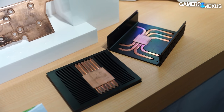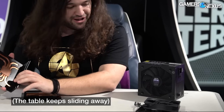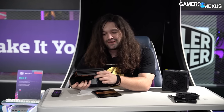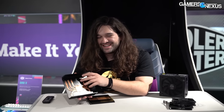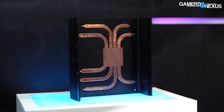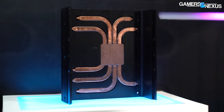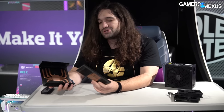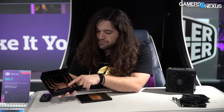So the answer for this is going to be a vapor chamber. This is a prototype where a power supply is a shell and the cage outside is aluminum — it's got some fins diced in it. You normally do want to try and use the cage for any kind of cooling, because it's a lot of surface area and a lot of metal, and you can actually get some benefit from it. Making it aluminum is good from that angle, but it is also expensive, which is why you don't normally see power supply cases in aluminum — they're typically stamped steel. This has got a couple of heat pipes.